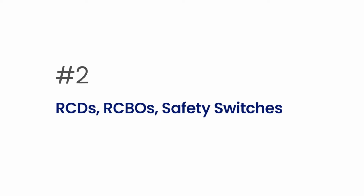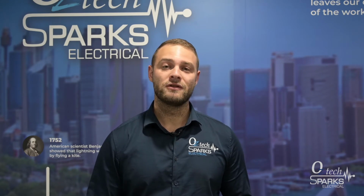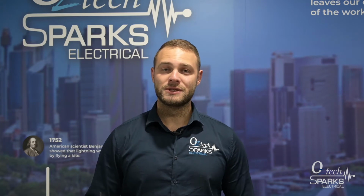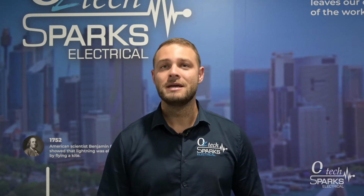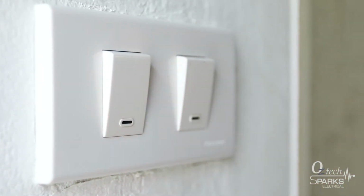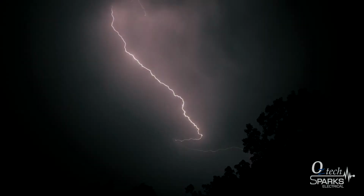Number 2, RCDs, RCBOs, and safety switches. An RCD or a safety switch is the protection device in your switchboard that's designed to save lives and is designed to shut off before any electrocution or bodily harm can be done. They must be installed in your switchboard, protecting all your circuits, and a safety switch will pick up on any earth leakage current that runs through any of your switchboard circuits, i.e. electricity that has gotten in contact with something it shouldn't. If I stick my fork into a power point, that protection device is designed to shut off within 0.3 of a second, preventing any harm done to me.